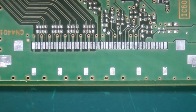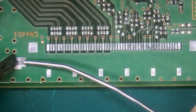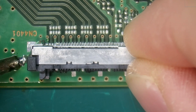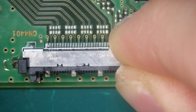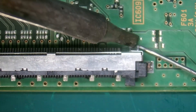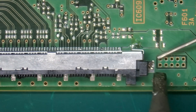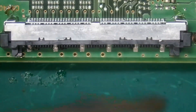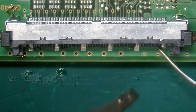For our installation, I'm going to start by adding some solder to our ground pads. We're going to slide our connector in until we're lined up. That looks good. So what we can do here is lock it in — we want to be careful. Now as you recall there is a little bit of solder on the bottom of this connector.